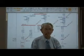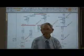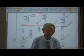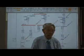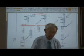That's the first step. You open the top breaker. That didn't work. You didn't have power. The second step, you closed the bottom breaker. And you had power for the emergency, but that didn't work because you energized everything up toward the top. And that's how you go through all these iterations and keep track of them so you don't forget, and an hour later you're doing the same one over again because you couldn't remember if you did it.